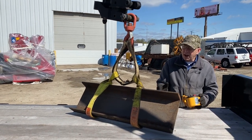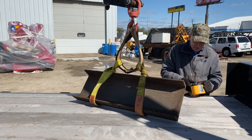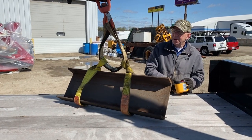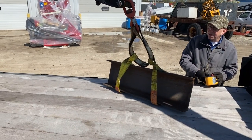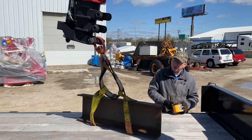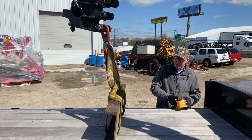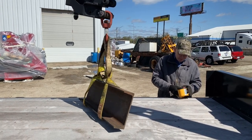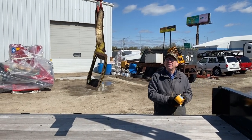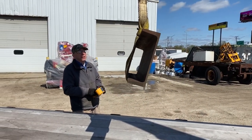Now we're dragging this across the air because the center point is over here. So I'm going to rotate over a little bit and try to make sure this lift is as smooth as it can be, comes up direct. And now we'll continue to lift. We have nothing much left to track. And we'll hit the main boom. I shouldn't be rotating over my head, so I'm going to back up a little bit here so we can rotate back this way.